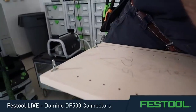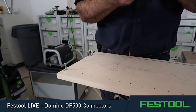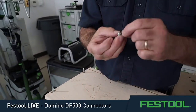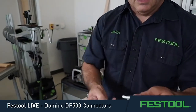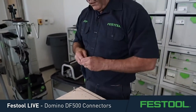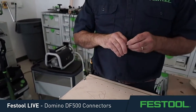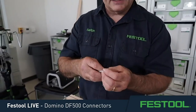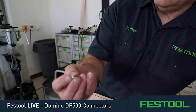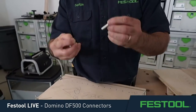and the reason is this, and Chris, I hope we can get a good shot of it. Look at this little hex screw. See how it's conical here? In the measurements we've given you, 15, which is easy. This is an easy one. But the next one's 28. And the reason we give you 28, it's to put in the cross anchor, because this little screw fits in this cross anchor. You'll notice it.